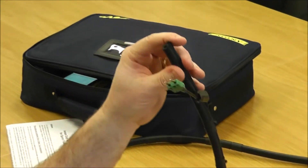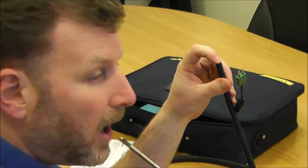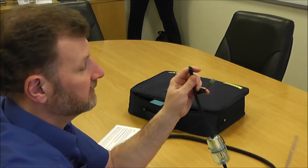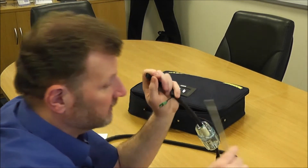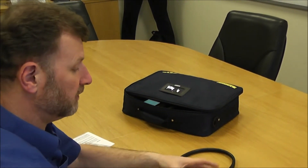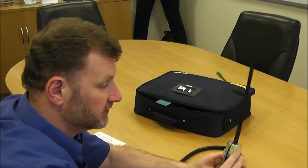Now I'm going to repeat the test I did earlier: hold my finger on that — nothing is letting by, so we know the readings aren't going to be depleted, and I've got a nice clear run. The flue probe is now ready to go.